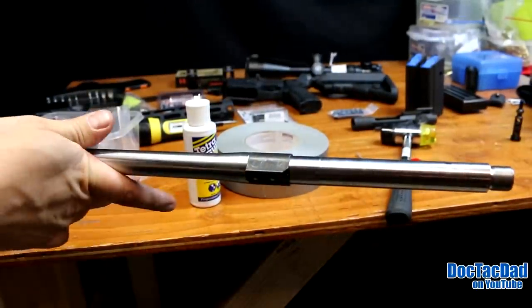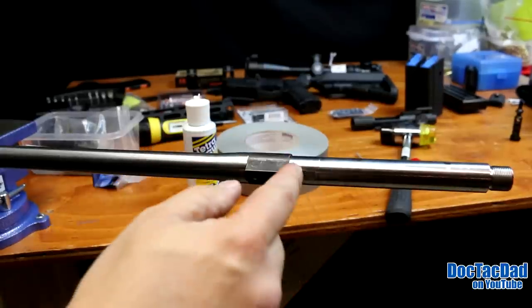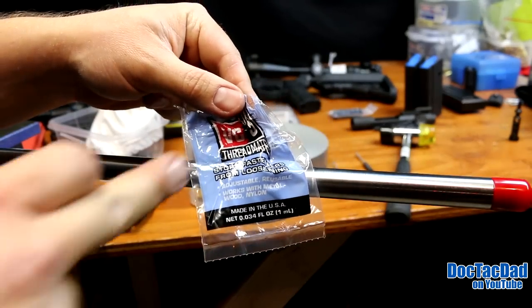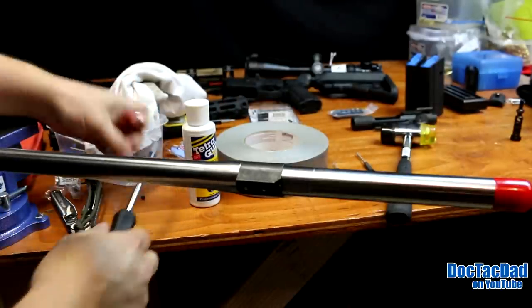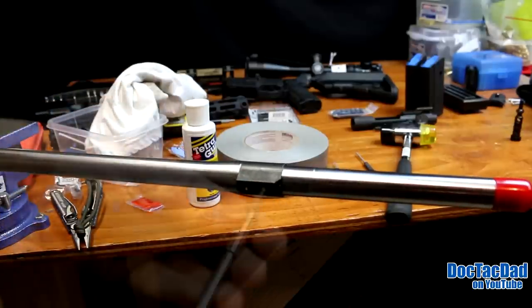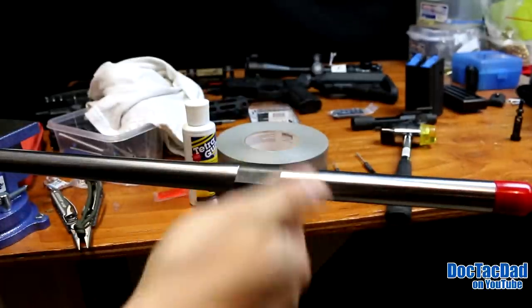The thing that's cool about the Lilja barrels is there's a flat spot on the bottom that they've actually milled out of the barrel. It allows you to line up the gas port fairly easily, and the set screws on the flat portion don't allow the gas block to torque at all — it keeps it in place. Midwest Industries, with their gas blocks, also comes with a little bit of Threadmate — it is red Loctite. So we're going to go ahead and use a little bit of this Threadmate on the set screws. Gas block is in place and locked down with our Threadlock.